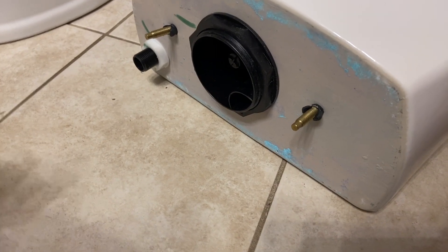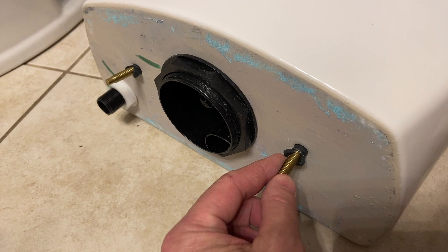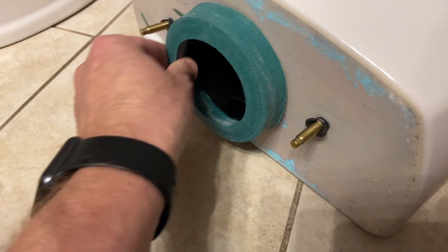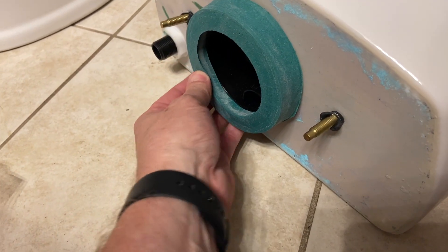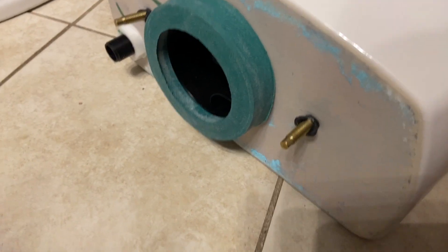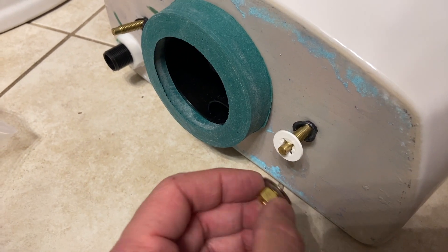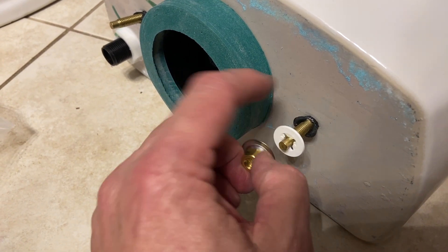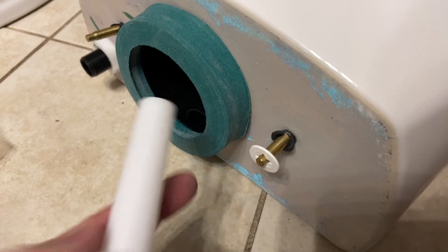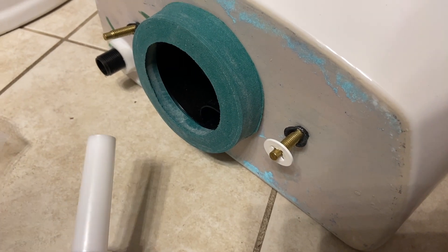We're at the bottom of the tank. This will go into the center of the toilet, and those two holes are where our two bolts will fall through. On the Titan, they've got a little retainer to help hold the bolts in place. This little gasket fits right over and sits flush. Then on the bottom of the toilet coming up, we'll be putting a little plastic washer on, and then a nut with a built-in washer. We're not going to tighten it super hard — we'll use their little hand tool because if we use a ratchet or socket, we're going to break the porcelain.